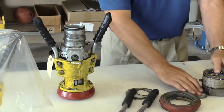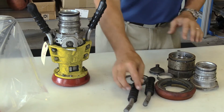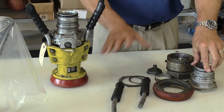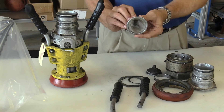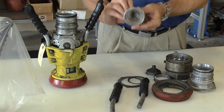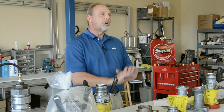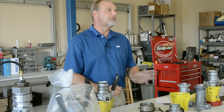These are the typical components we see inside of a valve, and every one of these needs to be cleaned and inspected before it can be reassembled. For example, there is a strainer on the inlet side — that is very important and must be intact and in working order. We do all of that, put it all through a blaster if needed, clean all the grime off, and then we start the reassembly procedure with a full set of repair parts.